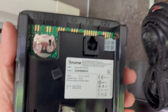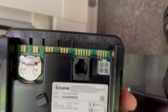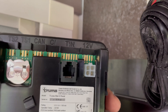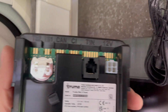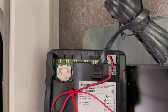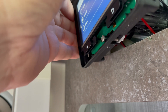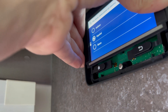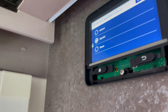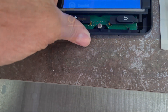So the connection: the 12 volt fits on that end there — to the extreme right — and the data in the data port. So that's the leads fitted. I've cable tied a loop on the back there just to take the tension off that lead. So you press it in and you'll hear it click. That's the two locking pieces firing up there and there. So it's pretty much in position.